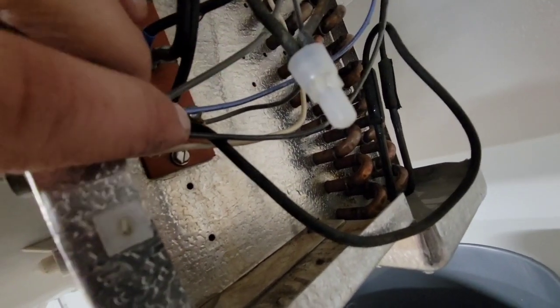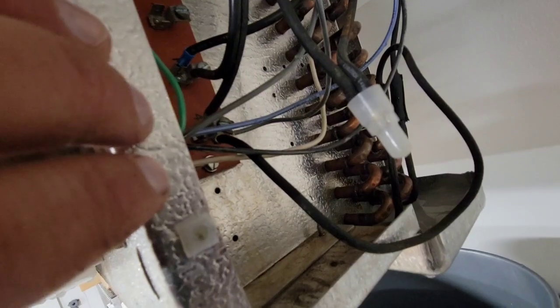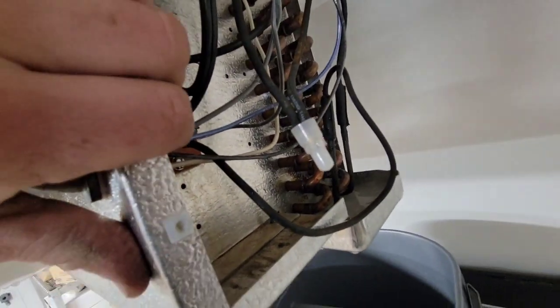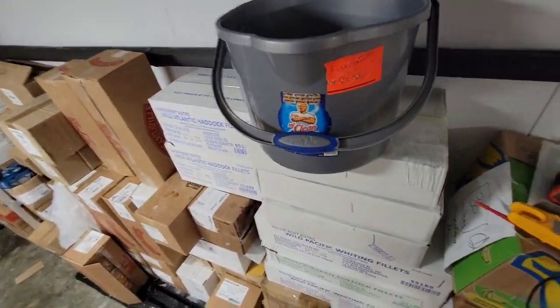But if I check them to each other — very important — check voltage from there to inside this nut, I get zero. So that means there's one line of power; we're losing a line of power somewhere. Remember, this needs 230 to work. So let's go look at the clixons.